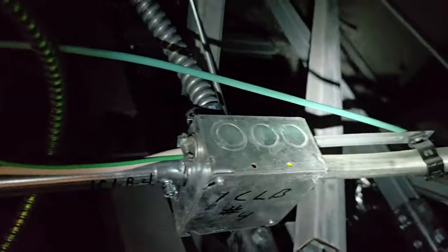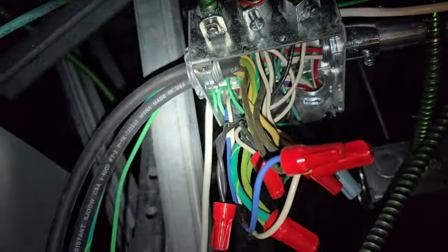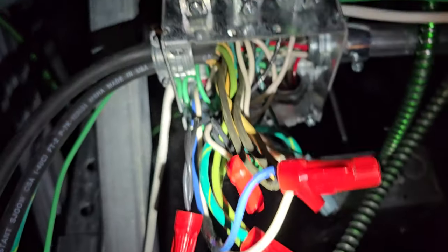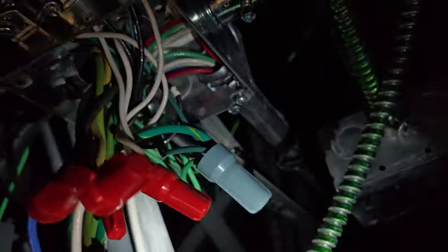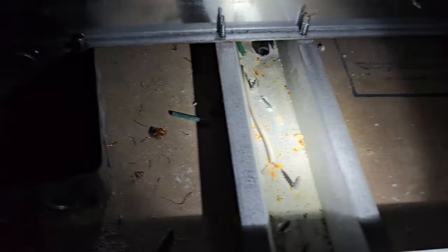So what's going on? You see these primaries right here — they come up like this through the whip, and the whip comes down to a box. I'm a little confused why there are whips in some places and exposed wires in others, because this is what I found when I came up here in the ceiling. If I'm not getting line voltage and my transformer doesn't really know what's going on, what are the odds that my problem with this boom has something to do with this? This is an absolute mess and whoever did this work was lazy and did a horrible job.